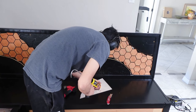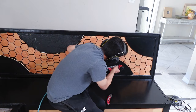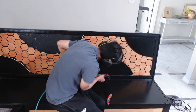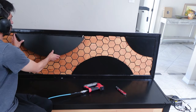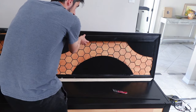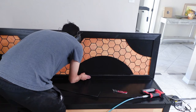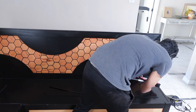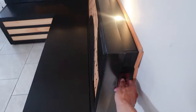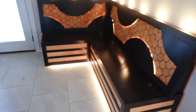Once the strips were in place, I attached the quarter-inch plywood arcs with construction adhesive to overlap those edges and cover the LED strips, then tacked them in place with a pin nailer using one-inch pins. For the final pieces, I attached a frame made out of quarter-inch pine — same process, gluing and pinning. The final step was giving it a built-in look by cutting out that section of baseboard and attaching it to the wall with screws. And with that, the bench was done.